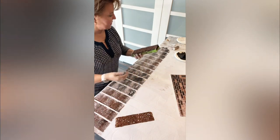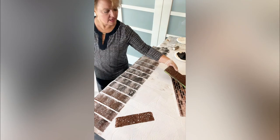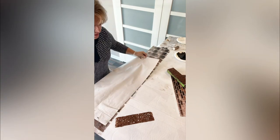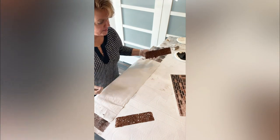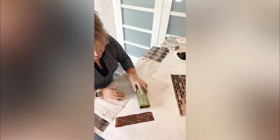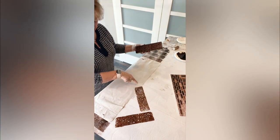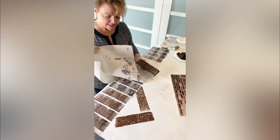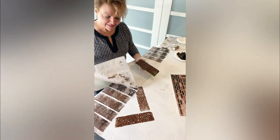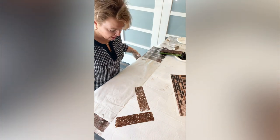I'm going to turn this first brick at what I call a 45-degree angle. If you've got some pieces down here that are wet, I'm going to lay a piece of notebook paper or trash bag over that so you don't stamp it. The next one's going to go right there. See how I got down in here and bled off on this? Just lay that right over that — that way you've got it. Consider your grout, your mortar line there.